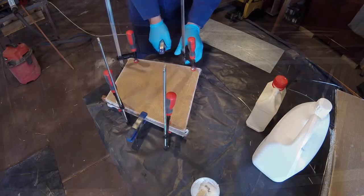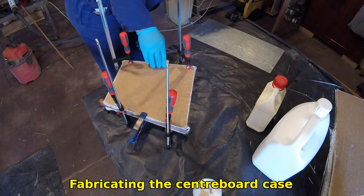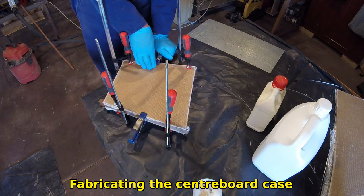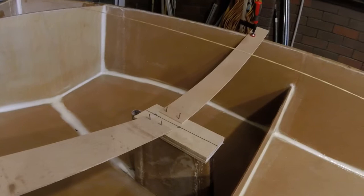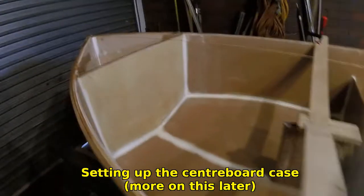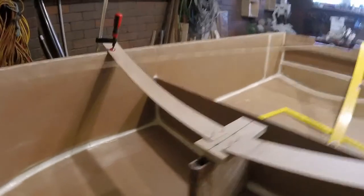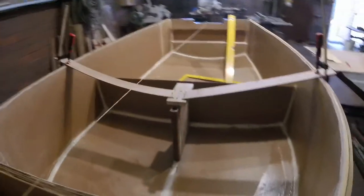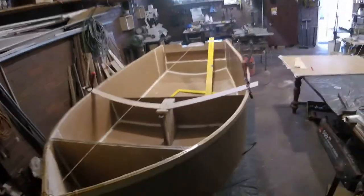So the board can be under the center of the sail — we will find out when we go sailing. This is a small boat with a rig that is like butterfly wings — there's nearly no power in this rig — so where the center of lateral resistance and the centerboard are placed isn't really going to affect this boat much. On a more performance-oriented boat, if you didn't get this balance right you'd wrestle the rudder sailing upwind, and given the size of the rudder I've made for this boat, I don't think wrestling is an option.